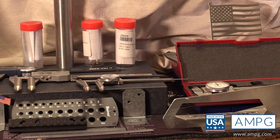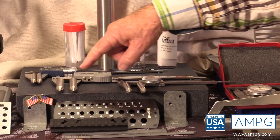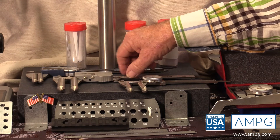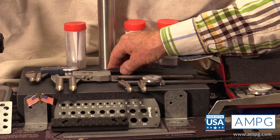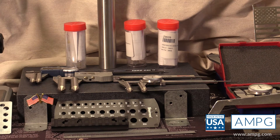On certain calipers you have the ability to preset, so you could preset to half an inch, making your datum zero and measuring directly to the center. With the dial caliper you can do it by just attaching the gauge. You could also take a digital caliper, bring it out to half an inch, lock it, and then put on the centerline gauge accessory.